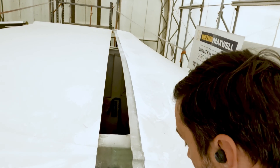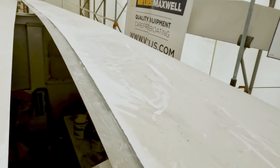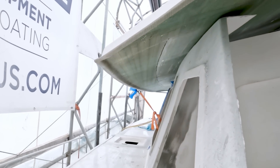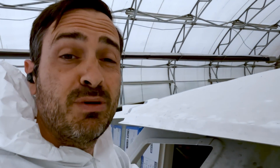As you can see behind me, we do have all the gel coat now stripped off of the flanges around this side and this side. But today I'm going to prep the inner surface in here where that mates on top of this flange. And also, because this is going to be my one opportunity to really get to them, I've already prepped the cabin top flange - that big piece that's molded right up in there. The strip along there is where that flange is going to mate from the cabin side to the cabin top. This is really my one opportunity to get access to it and prep that surface properly before we end up bonding them all together. So that's going to be my day - a lot more sanding, but we're getting there.